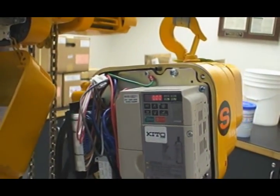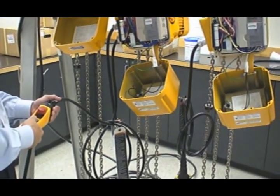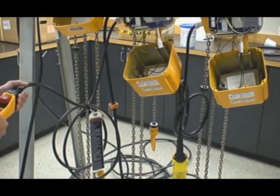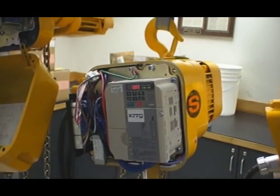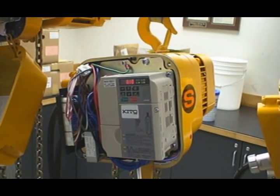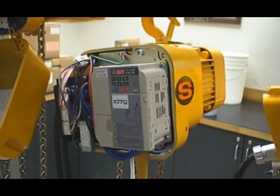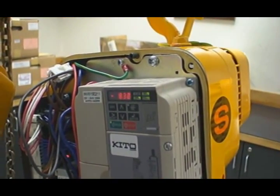Here we go — I'm going to operate my low speed, very very slow. Now I'm going to ramp up to high speed. The ramp-up time right now is set at about three seconds. If I simply want to go in and make that delay from low speed to high speed longer, I can do that with the delay all the way up to about six seconds. The nice thing about two-step is the ability, when I'm in low speed and go to high speed, to hold and maintain.